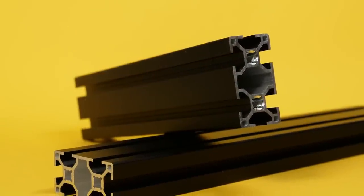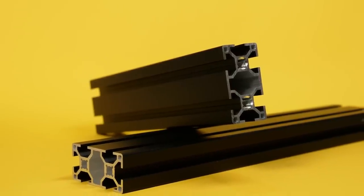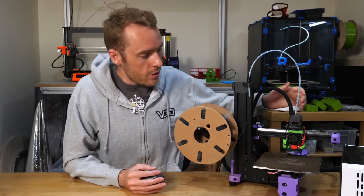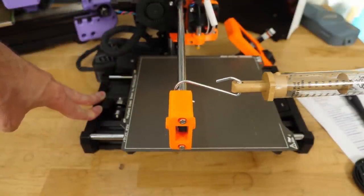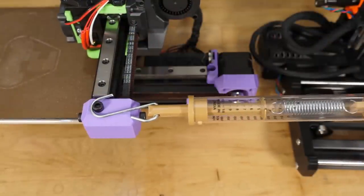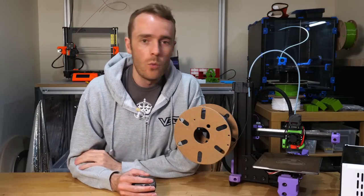The quality of the rails is actually pretty nice. The frame, which all the linear rails are mounted to, is all 30-60 extrusion, making it really rigid — with the exception of the cantilever arm which is 20-20 but has a smaller linear rail too. It's a lot stiffer than you'd expect if you've seen a Prusa Mini. You could lift this entire printer from the cantilever arm and it barely moves — very, very rigid.